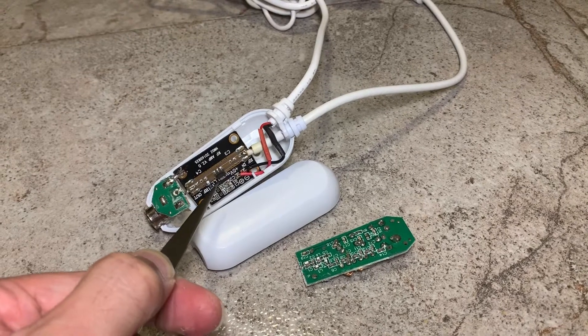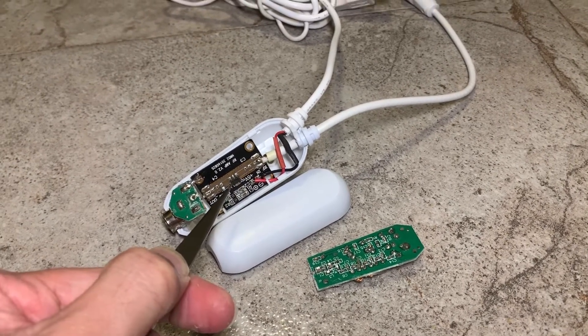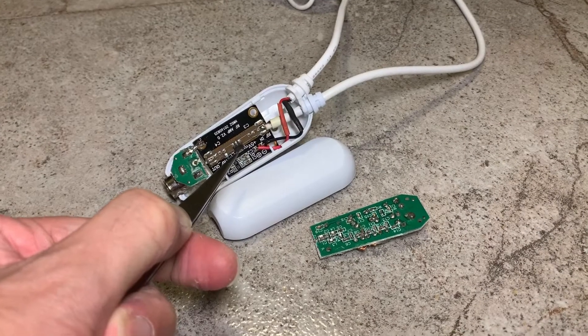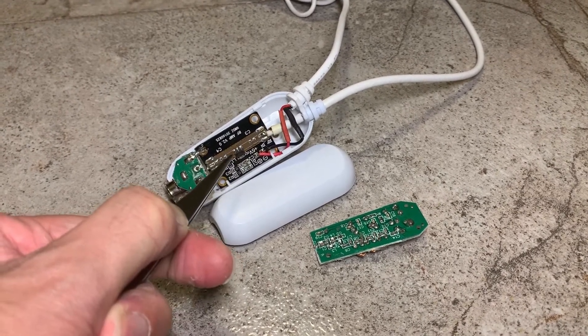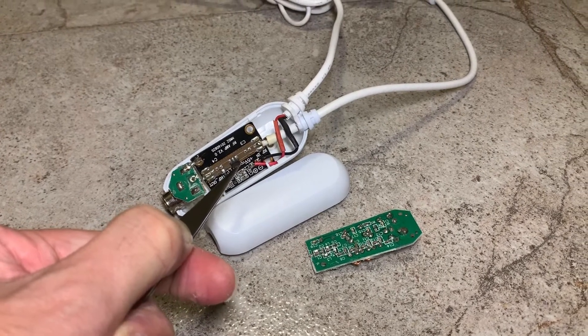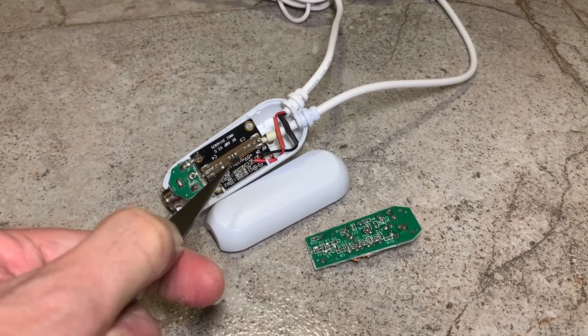This is the same amplifier that I tried to use on the DJI goggles to amplify the signal for 5.8 GHz FPV (first person view) flying. I'll post a link to that video below, so check that out if you're interested in LNA — low noise amplifier — to improve the video quality of drones. Anyway, I use the same LNA here in this TV booster.